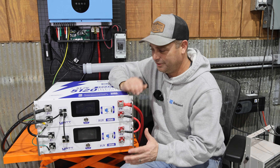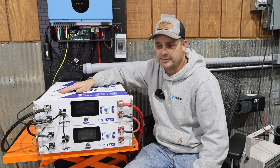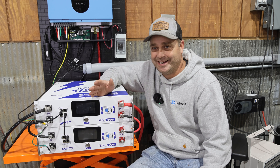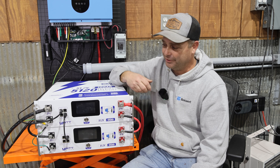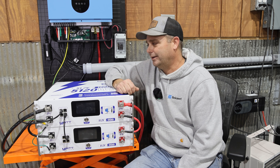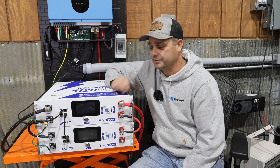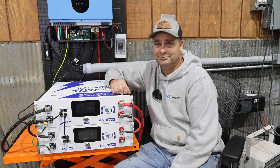Overall, I think these batteries performed well. We just had a glitch with the communication — not sure exactly what fixed it, but after getting the inverter communication correct and rebooting the bottom battery, everything started working. This battery is rated for 6,000 cycles at 80% depth of discharge and comes with a seven-year warranty as long as you register it on their website. For $699 on sale, it's a pretty good deal to get a server rack battery loaded with all the features most people are looking for. I'll leave a link down in the description below — I hope you guys have a great day and I'll see you next time.